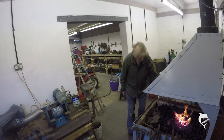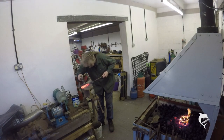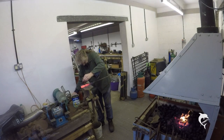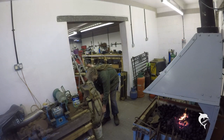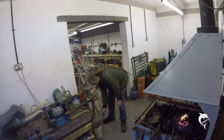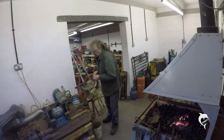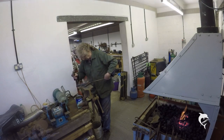Right chaps, last one. That annoying chirping you hear in the background is the CO meter going off, telling me that I've got CO in the room — but I already knew that. I've got all the dials going off. Give it a good slack off. Cool it down. And that's going to be a rivet. Before I rivet with these I'm going to have to check that they're soft because we may have inadvertently hardened them.